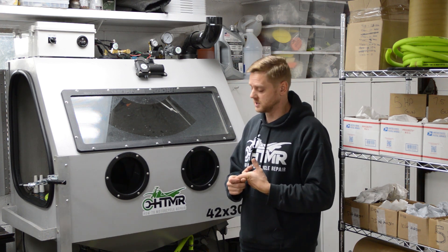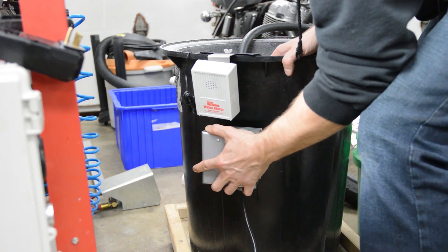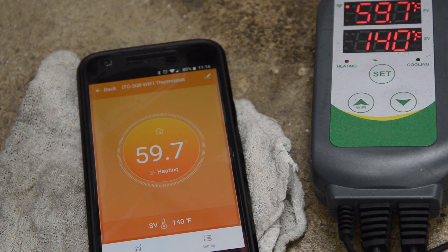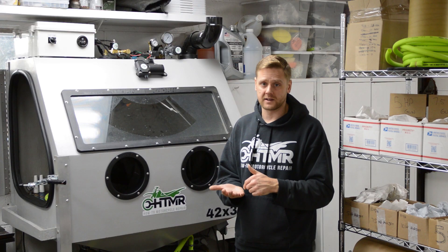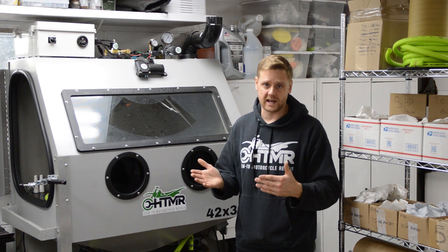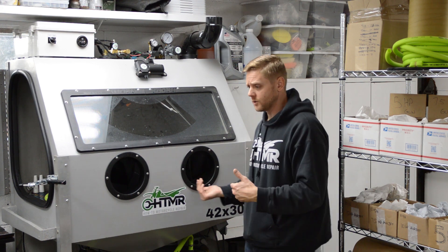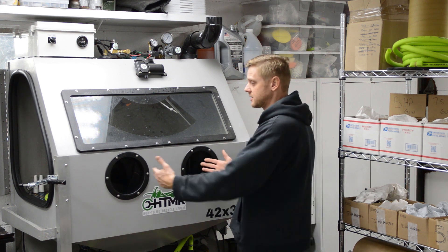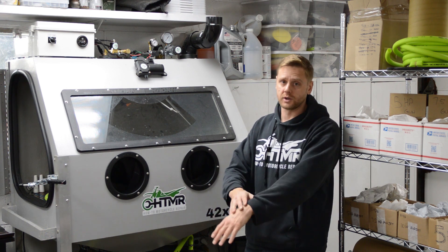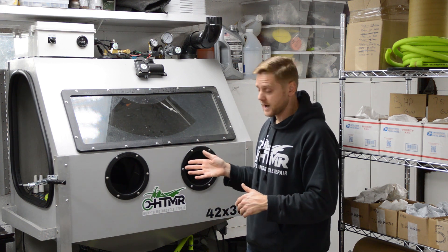The first and best option: in the plans I show you how to build an immersion heater, and I also show you a Wi-Fi temp controller. You don't need to use the Wi-Fi, but basically you can select a temperature. There's a temperature probe you can stick in the pit and control what temperature to set it at. I would run that and set it at 45 degrees. When you come out, bump up the temperature, because 45-degree water will go through the gloves and be uncomfortable after some time. So just bump it up to take the chill off.